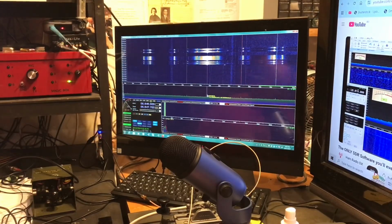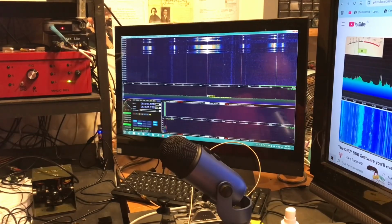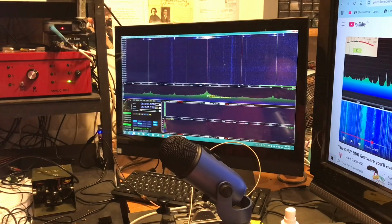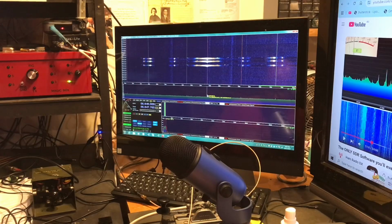We are watching Mr. Hayden and Ham Radio DX talking about SDR console. So some great content there, but I need to just show you now. After I went 150 on one side, 100 on the other. We probably should keep it even on each side, but I was just getting a bit worried I was going too far. But we are now at 6947. So I think the next grind that I do is I'm just going to go all out and do about 300 on each side, and I'm hoping that'll get me close to the bottom of the 40 meter band.